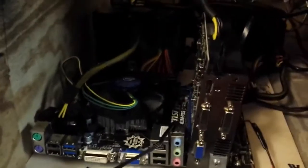So it's very important. Let's get everything unhooked, get the wires out of the way, and then we'll just slide this playfield monitor out. That is just sitting on that 2x4 back there on a VESA mount. And then we'll take a look at things after that's out of the way. Now that the playfield monitor is out of the way, you can get a better look at what's going on in here. We get a little more light in, a little more access.